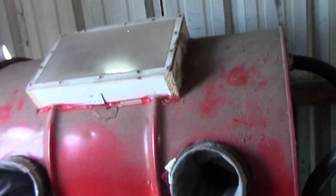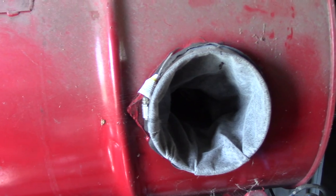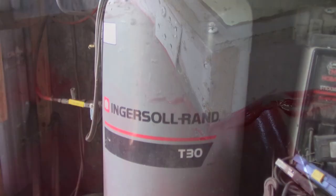I'm a tightwad, so for a sandblast cabinet I built my own out of a 55-gallon drum — I welded it up. I got the gloves at Harbor Freight and used metal coffee cans tacked in and siliconed for the arm holes. I built a door on the end, took some old refrigerator racks and made a rack inside. I use 100-grit red garnet sand and just have a cheap sandblast kit — I think they're about 10 bucks — mounted in there.